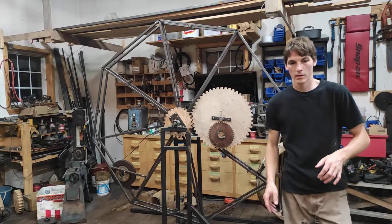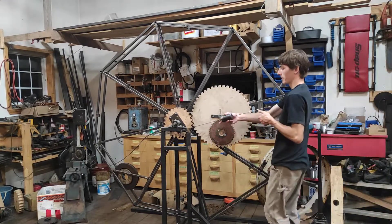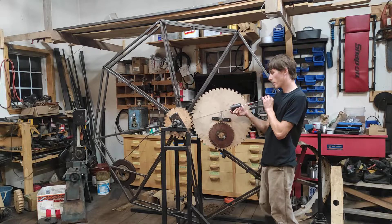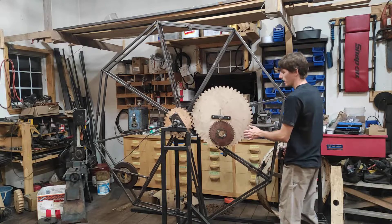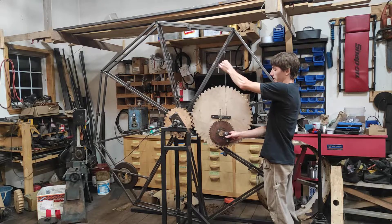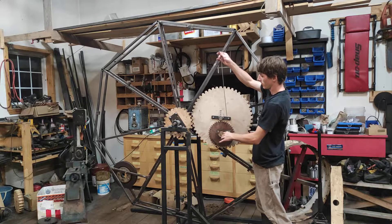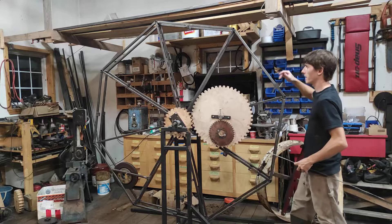So sliders — I don't like them, I think they really suck. But you've got to consider them sometimes. You've got to use a slider because a pivot, even a really long pivot, still puts a little bit of force this way or that way, even if it's close to 90 degrees. You've got to think about it.